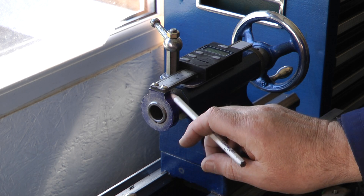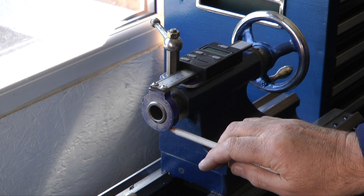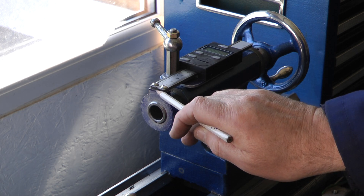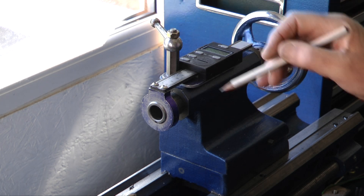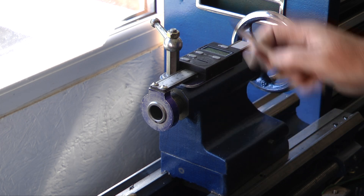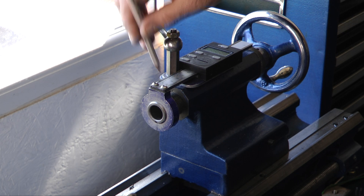I've made a ring that can be clamped onto the barrel — it's got a slot here and a clamping bolt ring through this way. I've worked out the height and machined a flat on there that allows the scale to bolt into. On here we've got a mounting plate that screws up to the bottom of the scale with two very short screws, and this is anchored through the stud that is part of the tailstock.